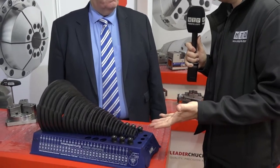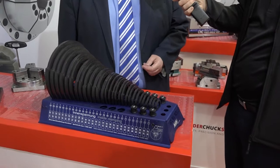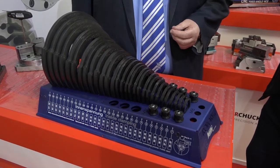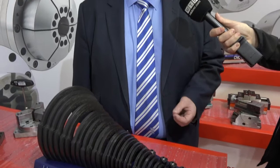Mark, Rotor Eye — we saw you at their stand at a recent exhibition, but what on earth is it? Well, what it is is a jaw-boring system. It's a system of a series of rings that are used to assist in the boring of soft blank jaws, so that you can bore them with the profile that you want.